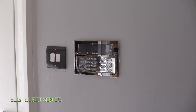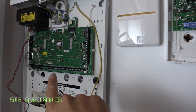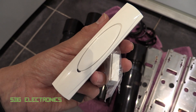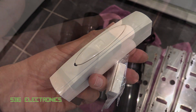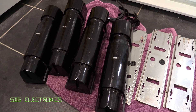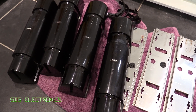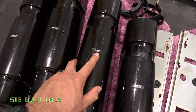The wireless expander connects via four terminals to the network interface and runs at 868 MHz. It connects to devices like a wireless contact that has two zones built in for wired devices too, and interfaces with things like a miniature contact with a reed switch and tamper switch. I want to integrate this with some beam pairs just arrived from eBay — I've just taken them apart and washed them as they were covered in cobwebs. They're quite expensive so I bought them second-hand, but they turned out to be way overkill.